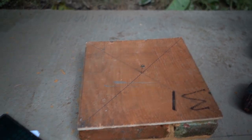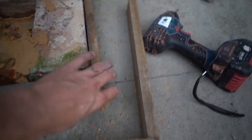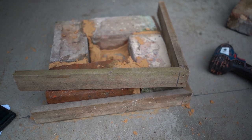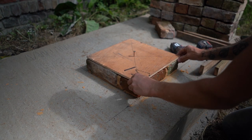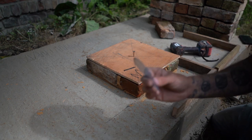So what does six degrees mean in practice? That is how many degrees this template is offset along one side per course. That's why we made the square template — we now need the other two L-shaped templates. One goes on the bottom course and the other sits on top of it but on the wonk — that offset is your six degrees. Let me show you exactly how to set this up.